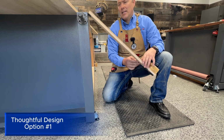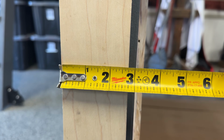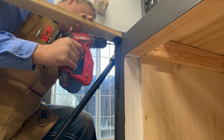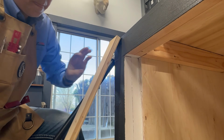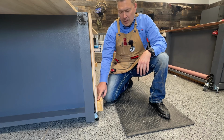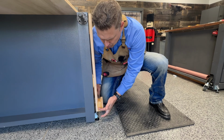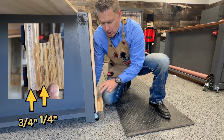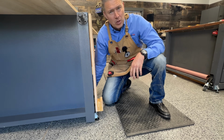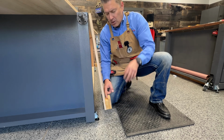So for this design, I did nothing more than take the width of this frame on the outside, and I made this piece of plywood a little bit narrower by 1/2 inch. And then I just got a piano hinge that has a non-removable pin that I used as my access point, if you will, on the top, making the length of it end just shy of where my wheels are. All of that is a simple, straight length. Make it adjust to whatever your length is. And then I created two different pieces, a 3/4 inch and a 1/4 inch, so that my total gap between the back and the front lip is going to be 1 inch, knowing that probably the max I'll be using is 1 inch to fit inside of that. And then just one slightly oversized piece on this bottom edge, creating that lip.